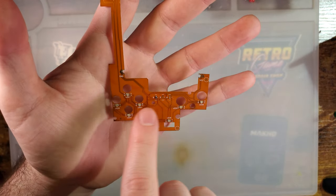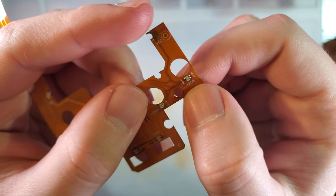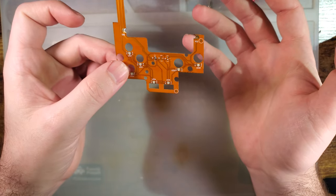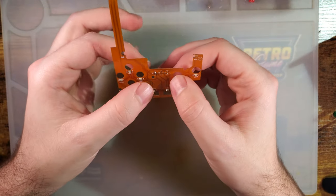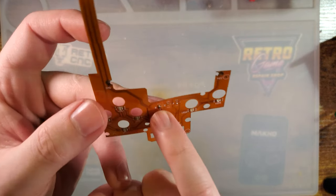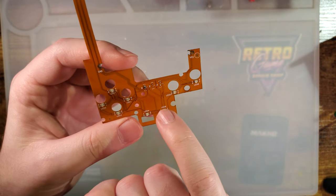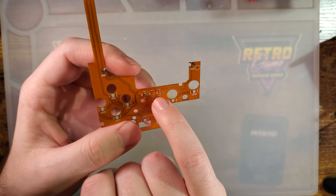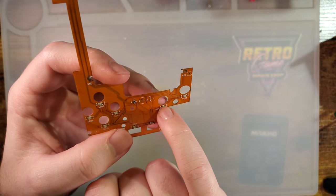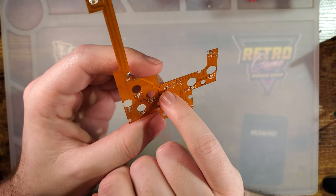The first thing is all of the button LEDs are RGB LEDs, which means they have red, green, and blue diodes in there. But with how this ribbon is constructed, there's no real way to use them all. You'd have to wire up a three-way switch. As it is now, you can select the color by taking this resistor here and moving it to one of these two empty pads. Right now it is soldered down to the R2 position, which I believe is green. Following this trace, I can see that R1 is connected to red, R3 must be connected to blue, and R2 is connected to green. So changing the color is as simple as literally moving that resistor.